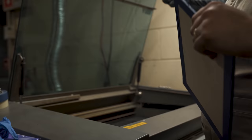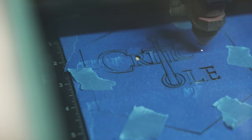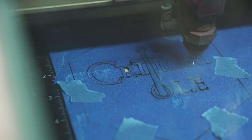We use a laser to do a lot of really fine detail cutting, and it gives us a lot of flexibility for what we can produce out of veneer and inlays and things. You can't really see the veneer - it's covered in blue tape or painter's tape. That's really because these pieces are so delicate and the veneer is so thin, they'll break apart if you cut them like this without any sort of backer.